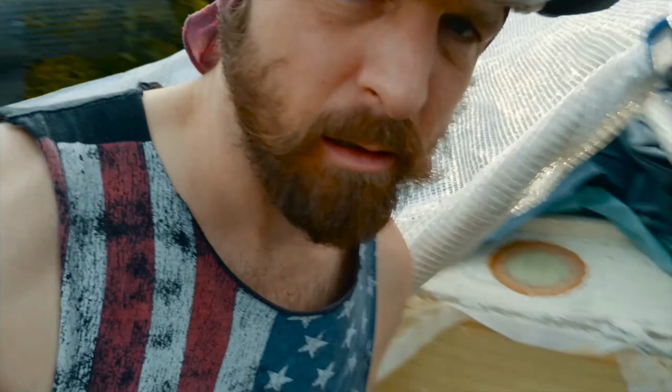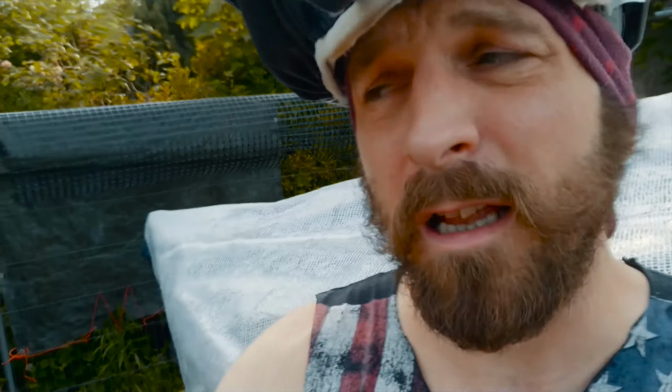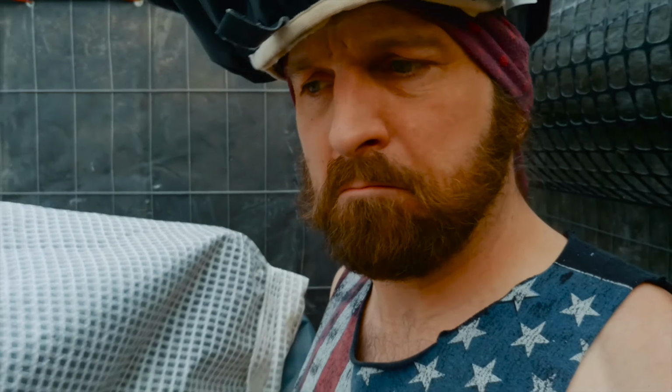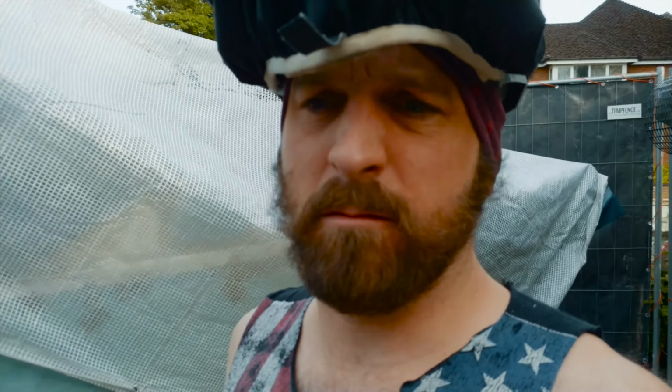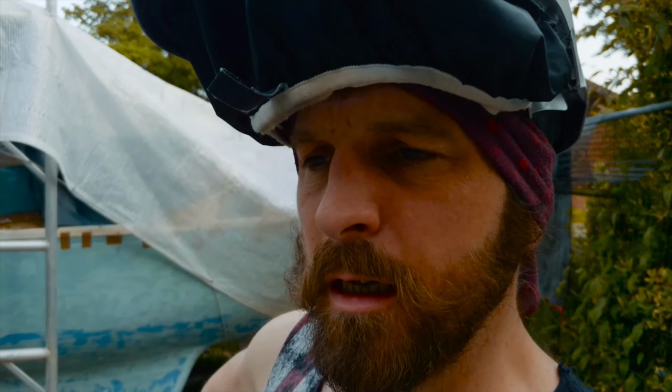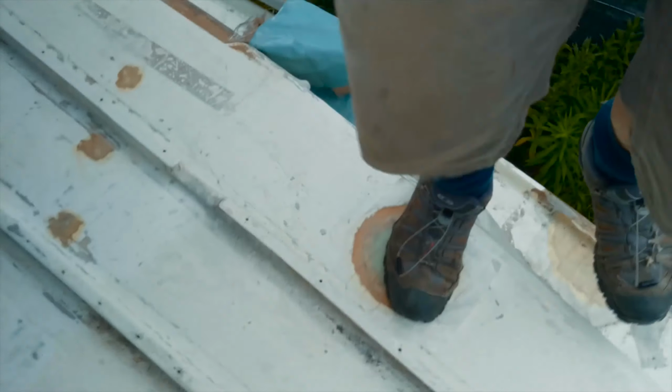Okay. Not quite epoxy best practice. I should probably have put on a bonding coat first and let that go tacky, according to that man in the West System epoxy videos, but they are just smashed in through it. Good, that's all finished. I've not seen that technique used before by anybody else. We'll see if it works out. I'll stand on it in a couple of days and see if it takes my weight. I don't see why it shouldn't be quite as strong. You know, six layers of epoxy glass fibre, biaxial glass. It's about a millimetre and a half each side, which is, I think, thicker than the deck build-up as it is.